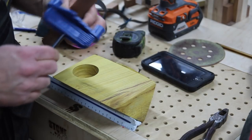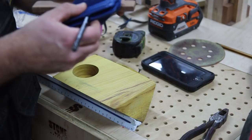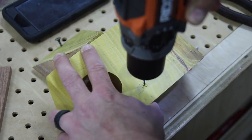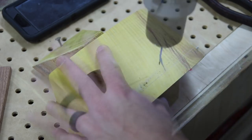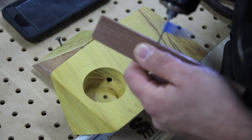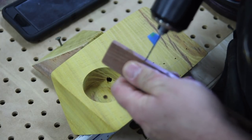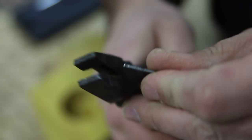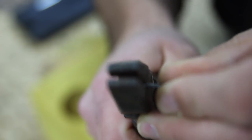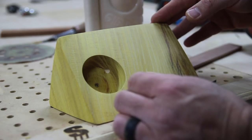I need to make a center line on the shelf, so I've got a centering jig also from Rockler to draw a line down the center. Then I transfer the marks from the Osage orange block to the shelf and drill holes in both — probably down about half an inch. I decided to do four hole locations rather than two. Then I take finishing nails, clip the heads off, and they act like little dowel rods. I apply some glue and place them into the drilled holes.